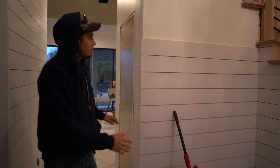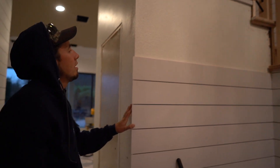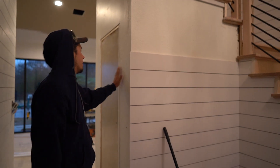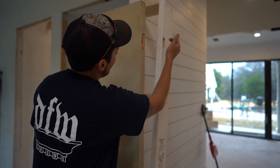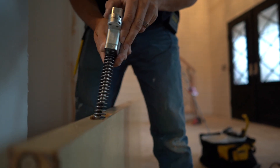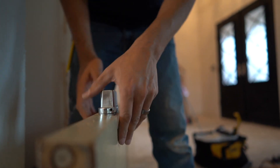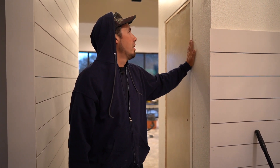What we got to do now is put this shiplap — it's just one by six MDF faux shiplap — up here and continue to wrap that around. But we spent the greater part of our morning working on this door. This door has Soss invisible hinges, so we spent a lot of time messing around with the jamb trying to figure it out, going over the instructions, drilling holes, getting the hinges set, really checking everything five times before we move forward.